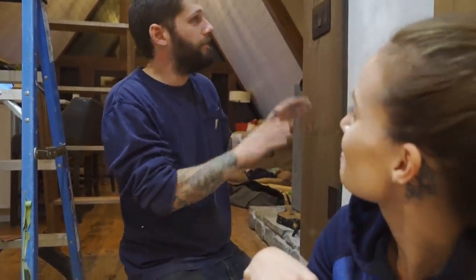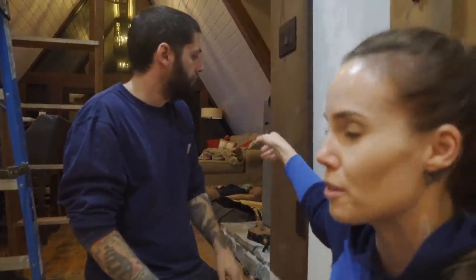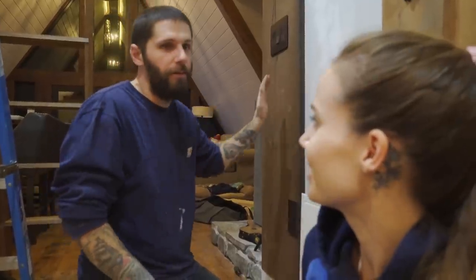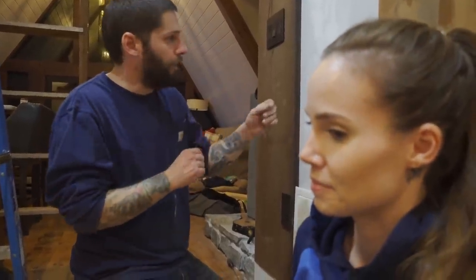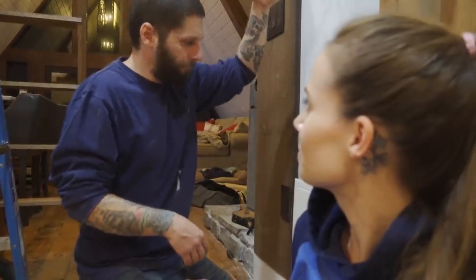This, you guys saw us put this up. This is a board from our local sawmill because we needed it to be a specific width. And I know you guys see me working on this a lot. The big old hump that was there has been gone, right? Yes. So I guess the last time, maybe I didn't mix it up well enough. I'm not sure, but there were some air bubbles in the mud. So when we sanded everything down, you had a lot of pin holes all over the place.